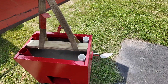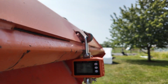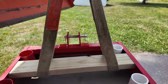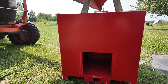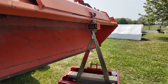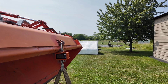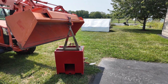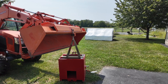We are all done — concrete is in and it's been setting up for about an hour. I've got this thing on the scale and we are right at 610 and a half pounds, which is basically exactly what I wanted. The nice thing is I've still got a decent amount of space to store random tools or anything I might want to take out to the pasture. The cavity at the bottom turned out just like I wanted, with only a little bit of water seeping in that I was able to wipe out with paper towels. I'll let this cure overnight, get it hooked back up to the tractor, and I've got a feed run coming up in the next couple days to show you the before and after on why this counterweight matters.